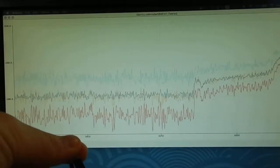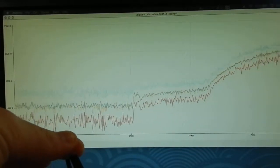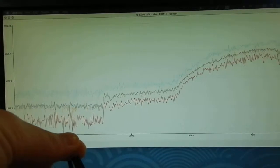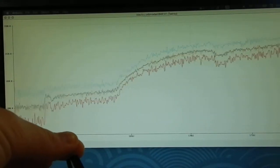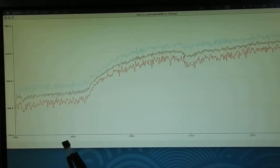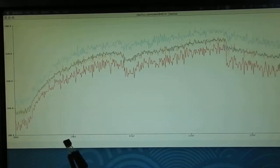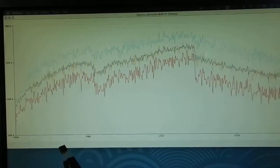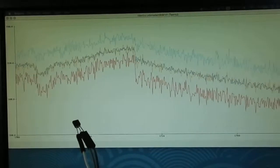then it goes up. And the average across 20 samples, so a sample update every 40 milliseconds, which is pretty good, is tracking pretty cleanly. It goes up really quickly, it takes a lot longer to cool down, so if I let go of it, you're going to see it track back down, but not nearly as quickly as when I first touched it with my finger. It actually says stuff like this on the datasheet.